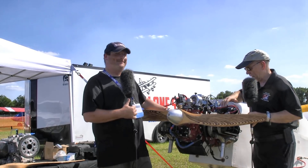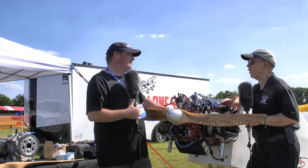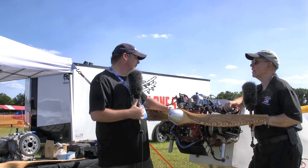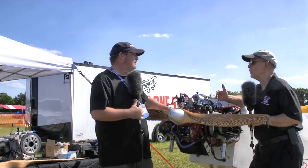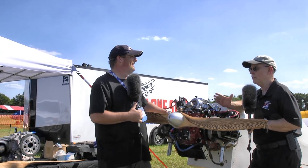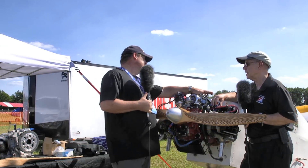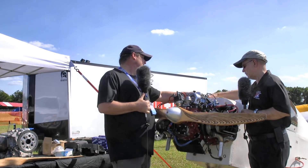The Volkswagen brand parts — we've got several different retailers that we go through to obtain those parts. They generally serve the automotive aftermarket of VW, which makes parts availability very easy to get a hold of — repair of old VWs or the original 1600-style air-cooled VWs. Other people are doing VW conversions — how are you different? We have a 40 millimeter CV Harley-Davidson carburetor, which we found great for aero conversion use.